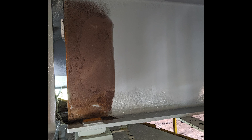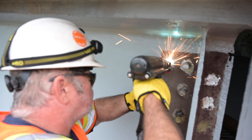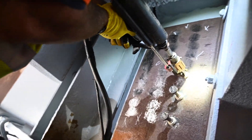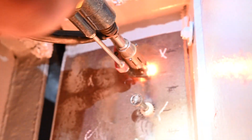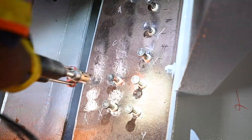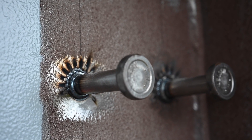The first step in the repair was cleaning the ends — removing all built-up corrosion to work with a plain steel surface. This is important so we're able to see the level of corrosion and also so we're able to shoot the studs on. One key concern when applying these studs is making sure we're getting a complete weld collar. The design of the repair is based on a full weld collar, and we actually get additional capacity from the studs from this weld collar, so it's really important to make sure the repairs are performing as designed.